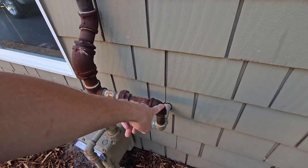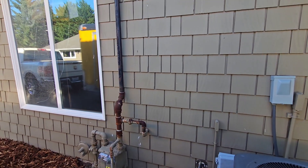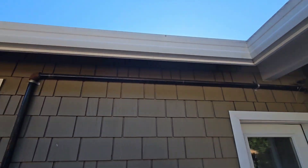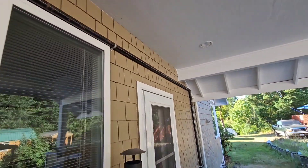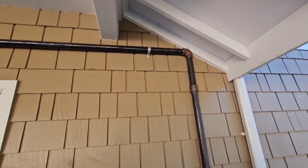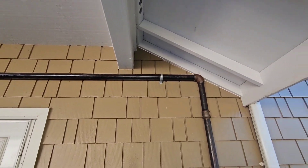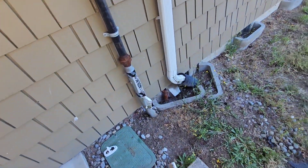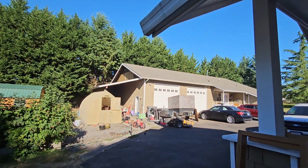I got a one-inch going in serving this house, which has a water heater and a fireplace. At some point somebody installed this inch-and-a-half gas main — unpainted, unprotected — two holes strapped to the siding. I see a gas riser there, inch and a half, and it comes over here and feeds a secondary home.